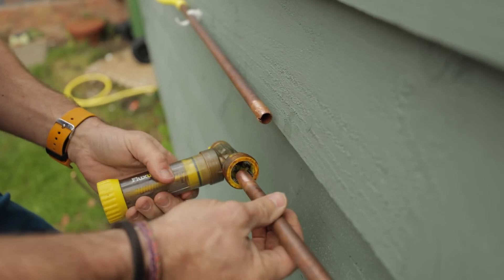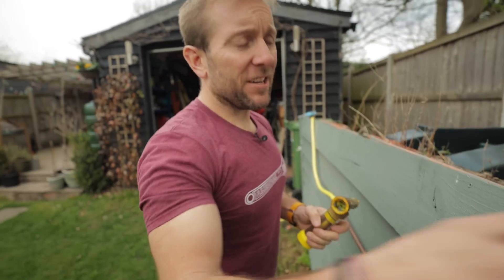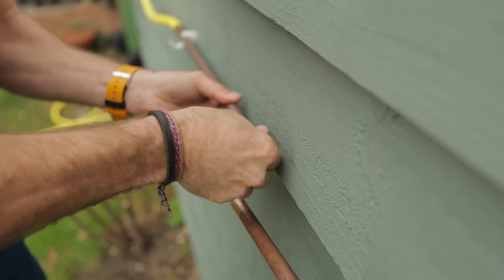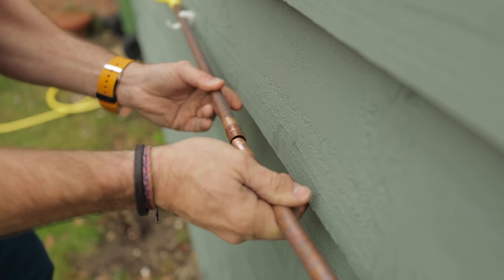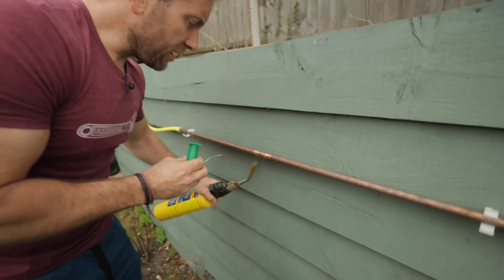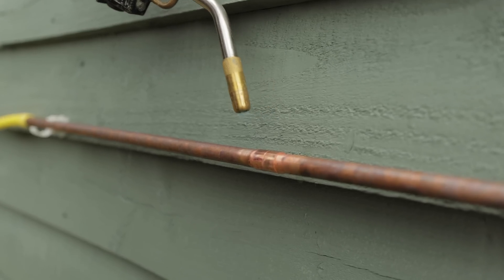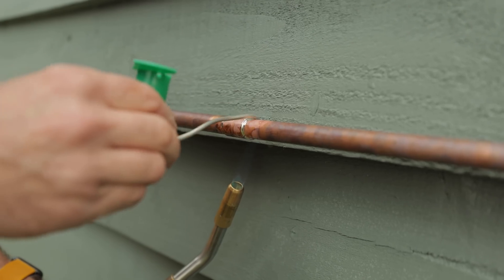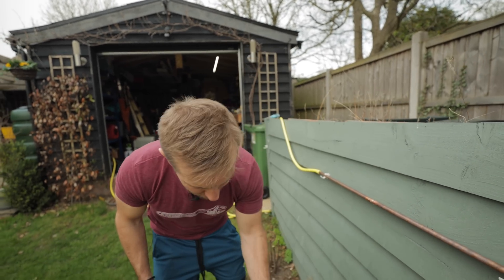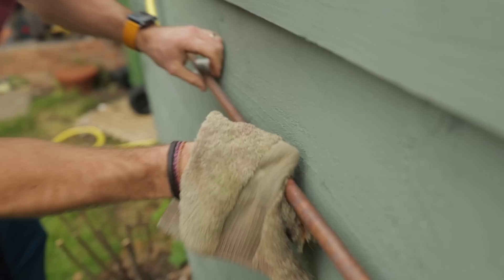For copper pipe, using the pipe cleaner, all these tools can be bought in our Amazon store — links below. A straight coupling — always got one of these in my pocket. Put that on there, and then you'd have to flex it and bend it real hard to get that in. If you want to make sure it's in properly, you can draw a bit of pen on there. Then a bit of heat and we're going to solder this up. I don't care if it doesn't look absolutely amazing, I just care if it doesn't leak — that's the first priority. Once you've got that, just give it a little bit of a clean down.